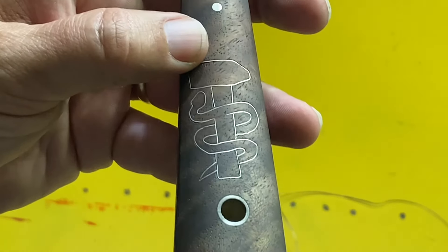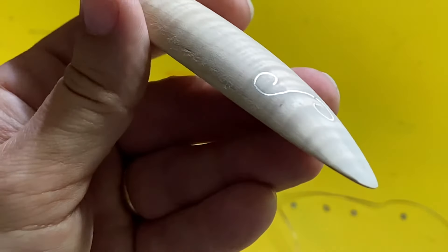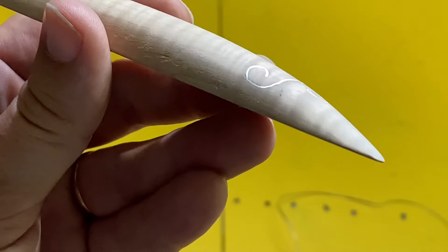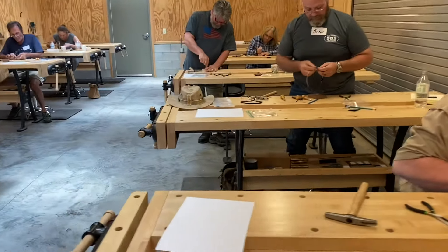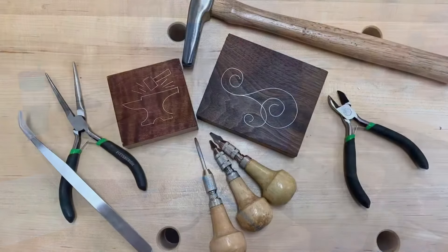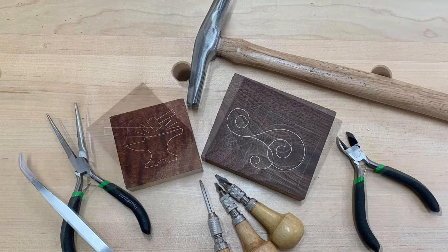This one right here is on a very curved handle, and I use a little bit of both of those techniques going into that one. The inlay is done, but the handle hasn't had any finish done yet. Here is the softer wire — I just do one piece of wire and did a scroll, and it goes right over there. What a lot of people do is, if they're going to use the half-hard wire, they usually have a flat section on their handle and do the inlaying in that flat section. So basically, if I have an item that is flat, I will use the half-hard wire — it looks lovely and works better for that. But if I have a curved handle, I'm generally going to reach for that thicker 13 thousandths wire with a dead soft hardening. It's just so much more flexible for curved handles, though you do have to nudge it to make it straighter and get any kinks out of those curves.